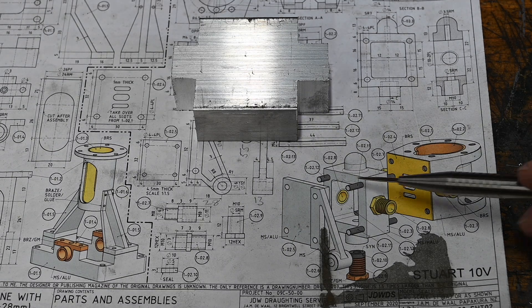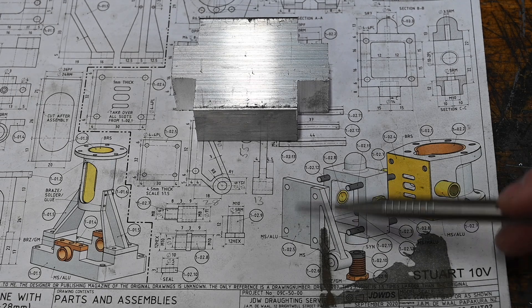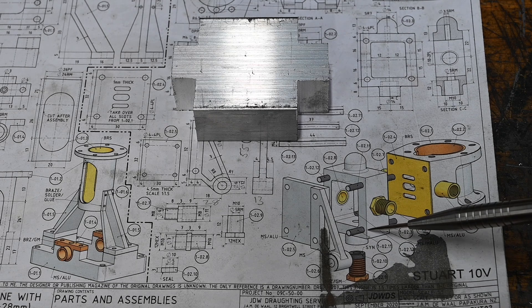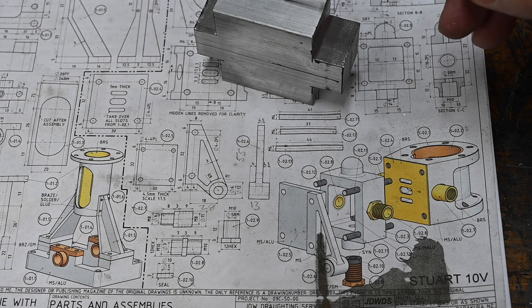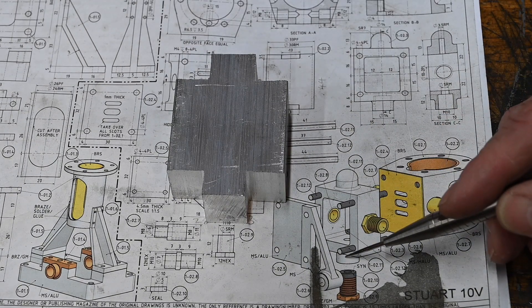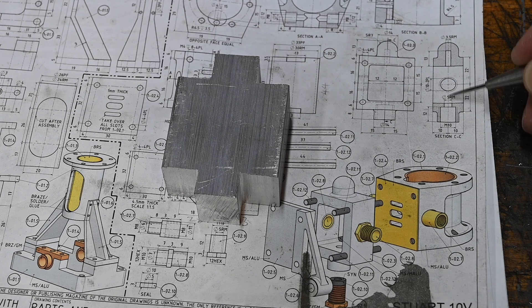Today I'm going to be making the steam chest and also this plate that goes on there. I've already made this bracket in a previous episode. The steam chest is what we're going to be making today. I'm going to do it in the four-jaw chuck. I've already cut out some of the excess — this is 25mm thick and it's got to be thinned down to 20mm, which I'll do on the mill later. The lathe work is to turn the little dome on the end and also to put a thread in for the rod for the steam valve.